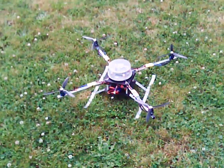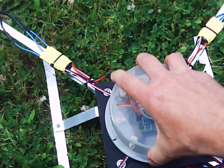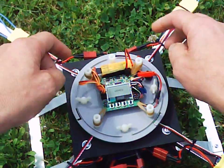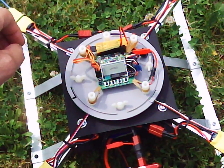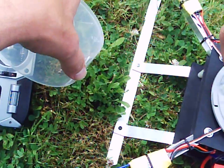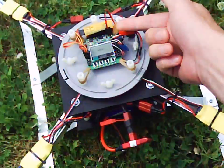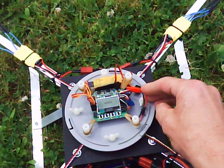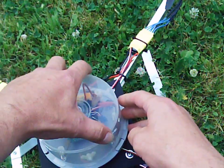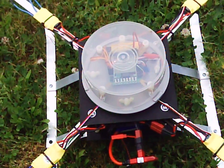Anyway, that's the KK board. One more thing — I put my obligatory rubber bands through the holes there, because I tried to hard mount it and it wasn't very stable. This is an idea you might want to try: I threaded the rubber band through there on both sides and hooked it, and it really makes it a lot more stable. I'd recommend giving that a shot on pretty much everything.